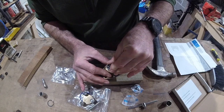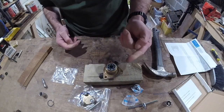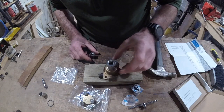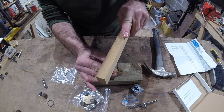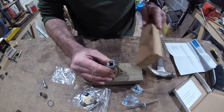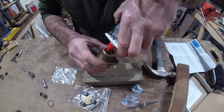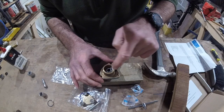These are usually a little bit stiff as they start to go in, but once they're past the top they just drop in. I might go one size bigger on the socket. With that it probably won't take much encouragement. There we go - beautiful. I'm just going to give that a bit of 3-in-1 on the race there. It's lubricated by the engine oil, but I don't want it to run dry or even damp for even a few seconds. That bit's done. Now, this other bearing.